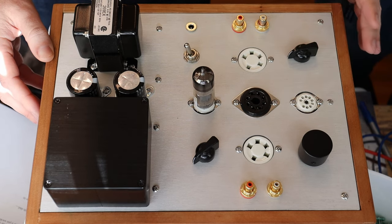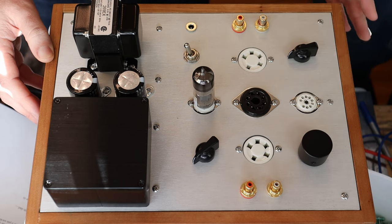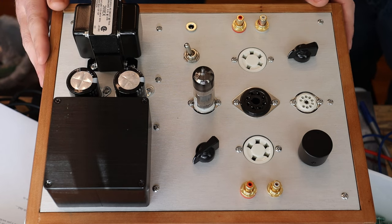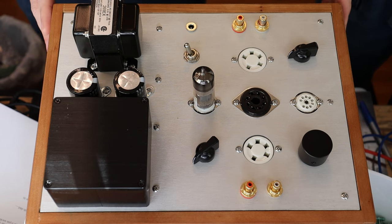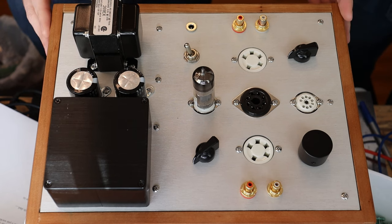But then we've got these beautiful big US-5 pins. They're for some very early single triode general purpose tubes like the 27, the 56, and the 76. They're very much the precursor to one half of what became a 6SN7 — something like the great-great-great grandfather of a 6SN7 tube. We've been wanting to listen to these things for ages, so I thought, why not include them on here?